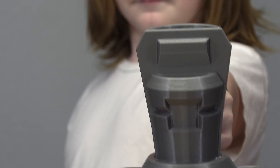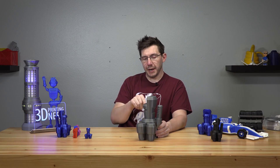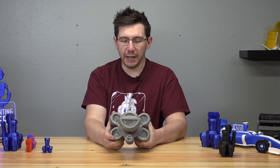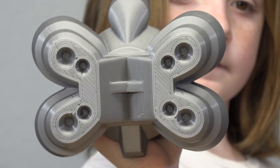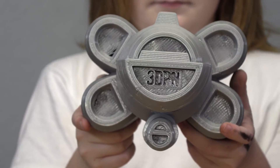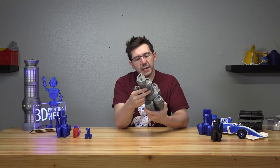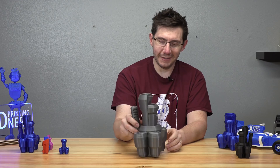There are some spots on the model where the infill wasn't enough. At 0.4 millimeter layer height, as it's pulling across the expanse at 5 or 10% infill, there's not enough support underneath — sometimes there's a little bit of hole. But this was just an experiment in embiggening. My impressions of this model on the TAZ-6: I think it looks cool. You can definitely tell where there are layer seams. The Moarstruder is a wonderful addition to the TAZ-6. I do see some layer inconsistencies, but it's not much — maybe it's just the light playing tricks on me. I love spaceships.